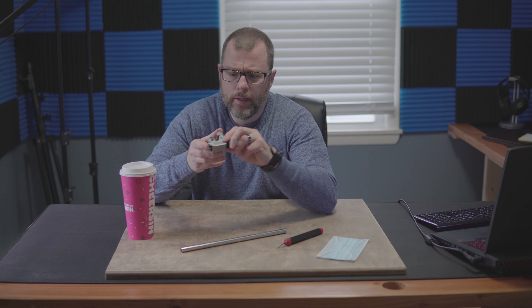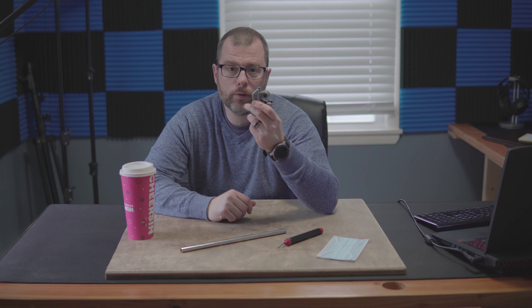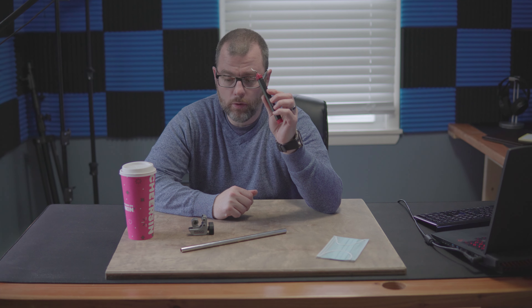This is a leftover tube I have - a 12 millimeter chrome tube - and the process was pretty simple for me. I ordered this online, it's a rigid pipe cutter. I think it will cut up to one and a half inches, so plenty big enough for any sort of water cooling tubes, even if you're going to go with 12, 14, whatever size you use. I also got this cheap Husky deburring tool so after I cut them I can deburr the edges so they aren't sharp.